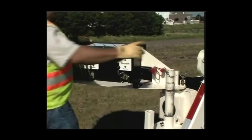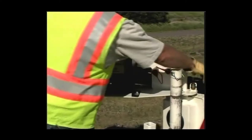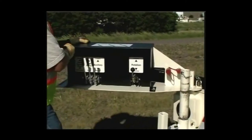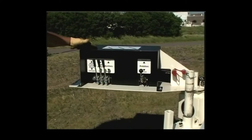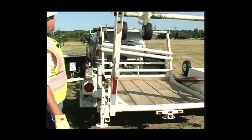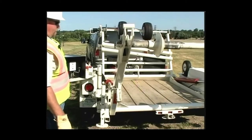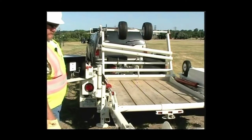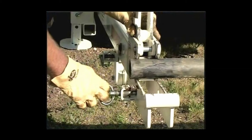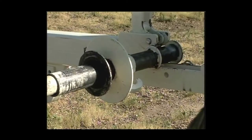With a Larson trailer, loading a heavy reel is a simple one-person operation. Adjust the hydraulic tray table to the desired location, then use the hydraulic controls to bring the lifting arm down to the height of the center hole of the reel. Remove the locking pins and lift the latches to open the reel lifting extension arms so they are ready to accept the arbor.